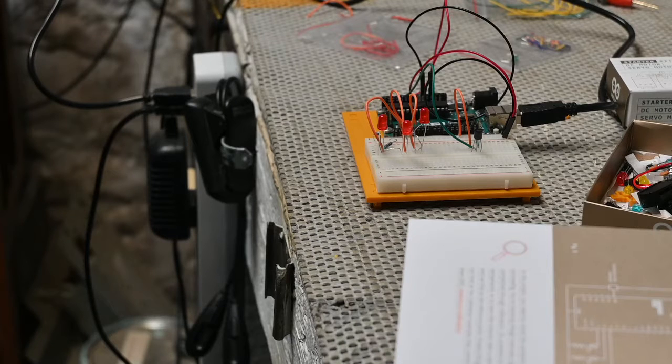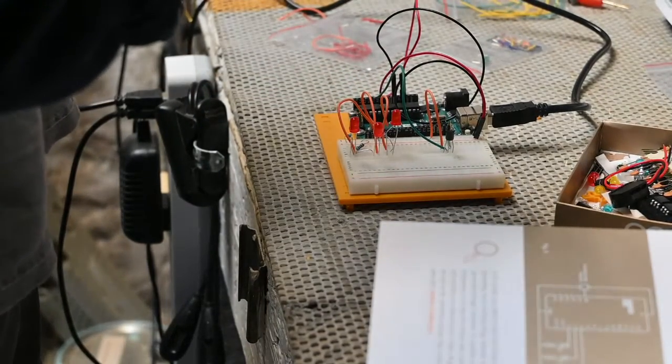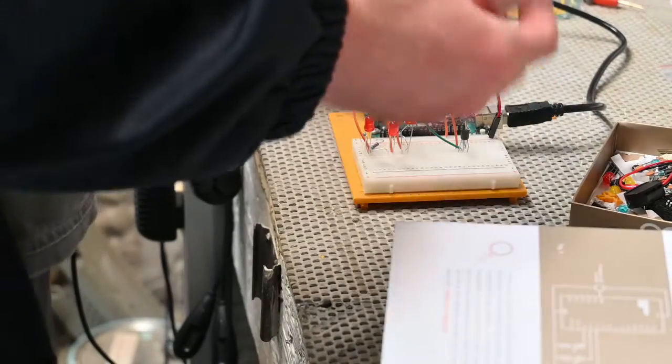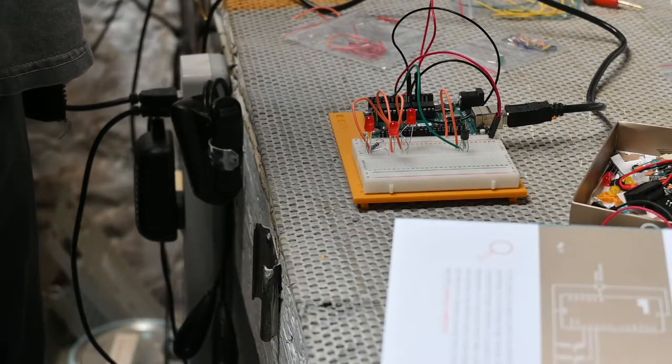The temperature sensor outputs a change in voltage depending on the temperature it senses. There's 3 pins on it. One connects to ground, another connects to power, and the third output is a variable voltage to your Arduino. Alright, we're just going to get some more parts out here. The TMP36, it's a nice temperature sensor. It's convenient because it outputs a voltage that changes directly proportional to the temperature in degrees Celsius.